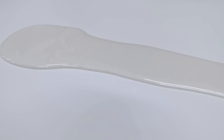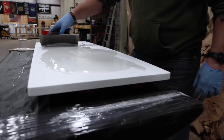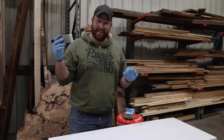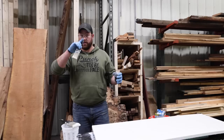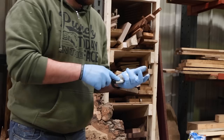We go with the white base and just start out with this in the center, then use the scraper to kind of spread it out — it'll self-level. The next step to eliminate all the streaks is literally what he calls chopping. You come back in and smooth it out. Actually you're supposed to pull the fibers off the brush first, and then you come back in and chop — that's what evens the color out. It looks pretty cool; it's got some cool depth to it. Next thing is the black. You want to clean the brush off too — we're using like super cheap two-dollar paintbrushes; you're gonna throw these away.